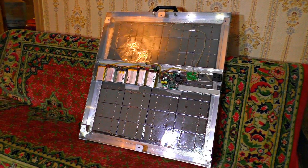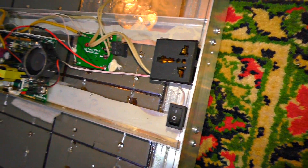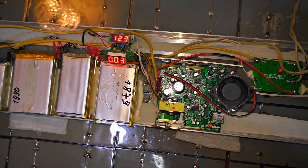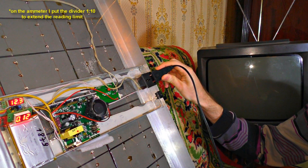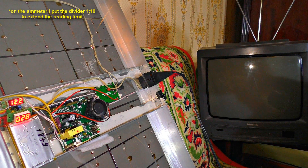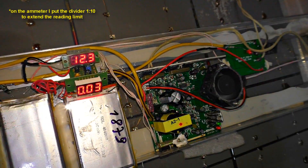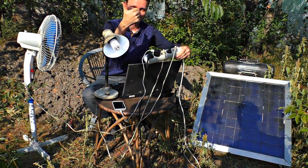Now let's check it out. Let's switch on the inverter. I've added two indicators — one shows the charging percentage and another shows the current consumption. If you know the voltage, you know the accumulator's charge: 100% charging means 12.5V, and 9V means 0% charge, so the battery is empty and the inverter will turn off. Looking at the amperage indicator, we can see how much power is being consumed right now.